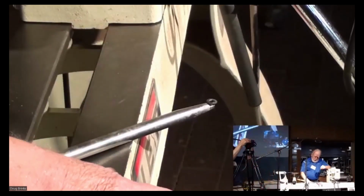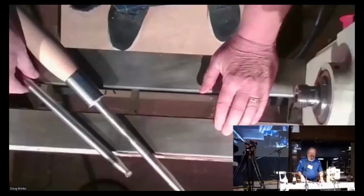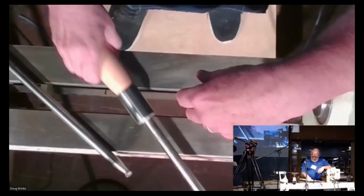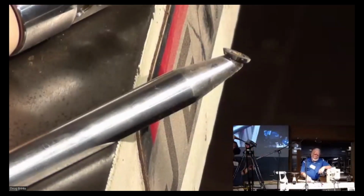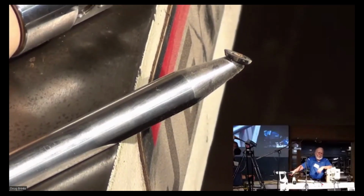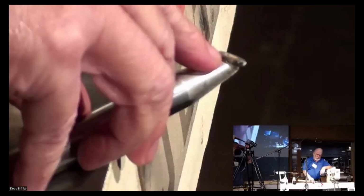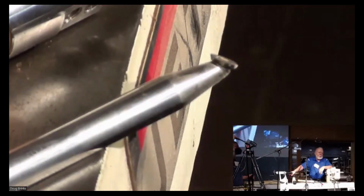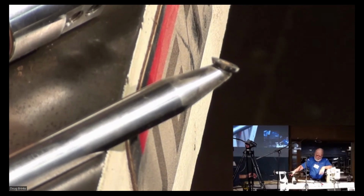When Carter asked me to come up with another tool, we were already producing this Pro Tool. And that's a Keith Lochner. Keith is a resin turner. And because of the patent on negative rake cutters, we weren't able to come out with a cutter yet. It's in the works. So what Keith wanted to do is angle this down. This is angled at 30 degrees. It produces the same ribbons as a negative rake cutter, okay? I don't turn resin, so I haven't used the tool much.